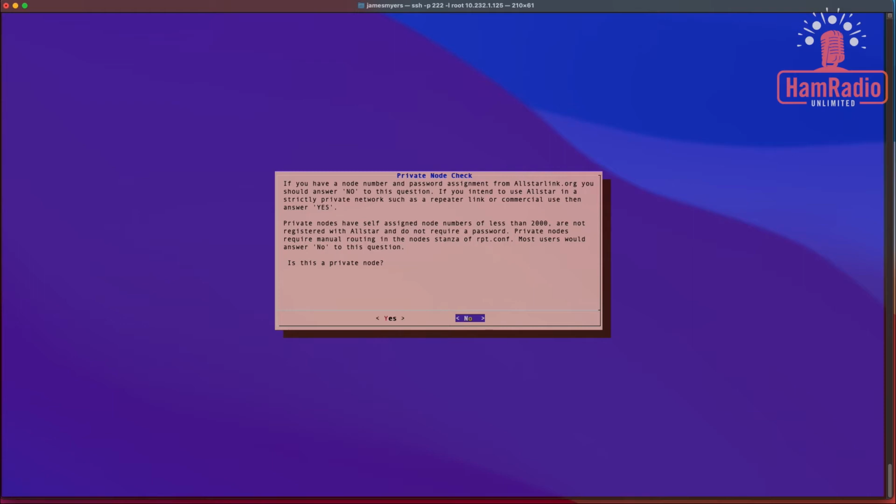If you're on a Windows PC, you do not want to use the number pad on the right-hand side when entering information. Lots of times those keys will generate, depending on what mode it's in, some weird characters, which can cause some problems, and you may have to run through the setup once again. Just for purposes of continuity, I would say even on a Mac or a Unix machine, do the same thing. Do not use those number pads on the right-hand side. Use the number keys above the QWERTY instead of using the ones on the right.